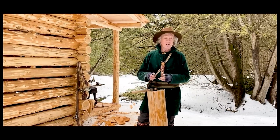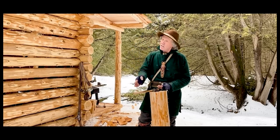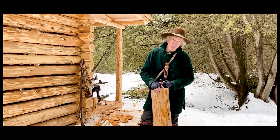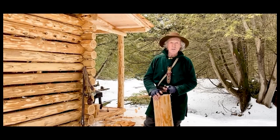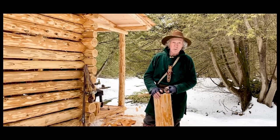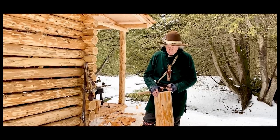And the test one does is to take a strip of bark off the bottom and rip upwards. If the bark tears straight up the tree, the grain on the inside of the material will be straight and good enough material to make shakes from. But over the years, we've depleted a lot of the good stuff with canoe building and making shakes for other buildings, chicken coops and roofs and such. So I may have to buy some of the shingles for the cabin.